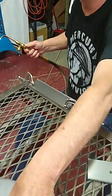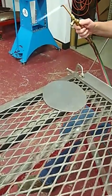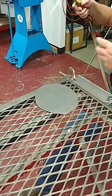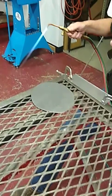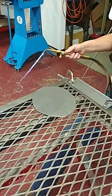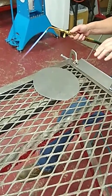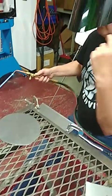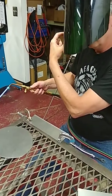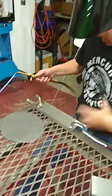To gauge the amount of heat required, I should be able to bring it to a molten state in about three seconds. If it takes too long, you start to jitter. If you're too quick — one second — you haven't got enough time to focus on the joint. You'll also notice that when I'm looking straight down comfortably, I'm looking below my lens. When I go to weld, I tip my head down and adjust my helmet so I'm only looking through the first couple inches, so I can always see the joint free and clear.